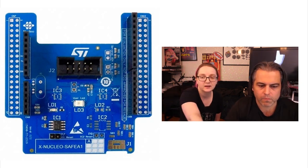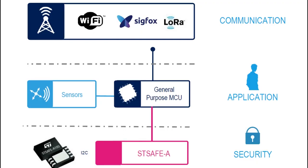There's a nice diagram — a flowchart from the presentation. So you have this ST-Safe chip, which is a hardened crypto and hashing authentication chip. You communicate to it over I2C, over any microcontroller, and then you can connect over any wireless or network protocol you want. It can be used for authentication — making sure a product is genuine and permitted to talk to an IoT service. It can also be used to speed up TLS authentication. A lot of chips don't have a built-in crypto hardware accelerator, but this chip handles hashes, AES encryptions, envelope signings, and more very, very fast. These chips can be used as a co-processor for TLS to speed up connectivity and handle the public key encryption handoff.